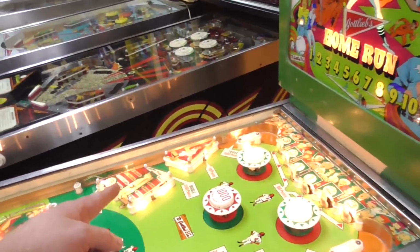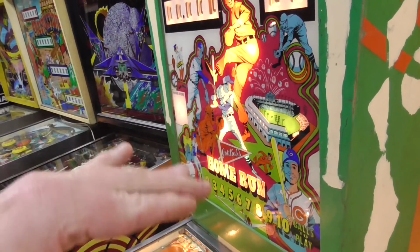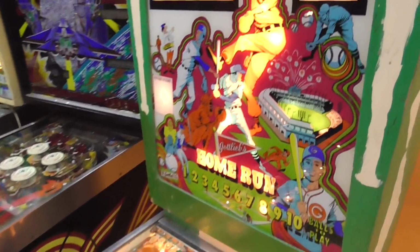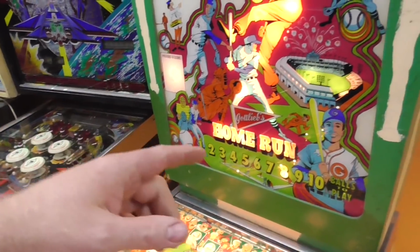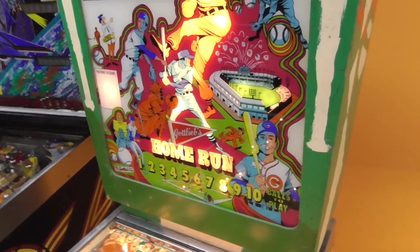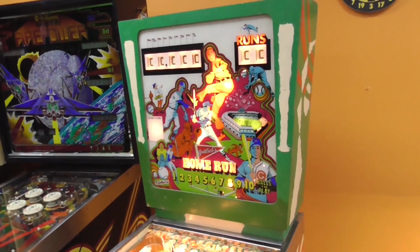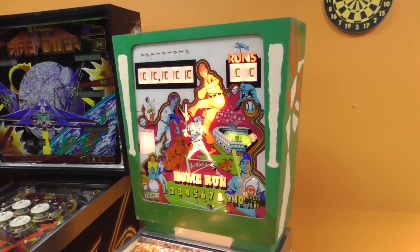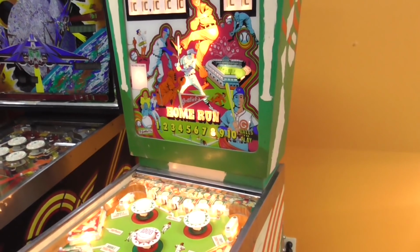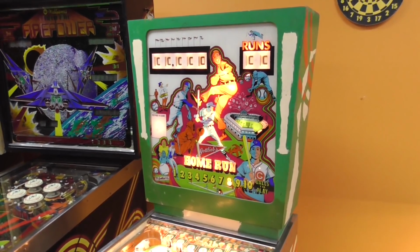So whenever you hit the 10-point switch, it pulls in the 10-point relay. And if that's stuck in, then their switch is closed, and maybe the chime's closed or whatever. And maybe whenever the score motor's turning, if one of those switches is closed or something, it makes it subtractive of a ball in play. So there's some reason it was doing that that was being caused by the other issue. So I fixed the one that I understood, and it just automatically fixed the other one. And we don't have to figure out why it did that. It makes it a little easier on you.